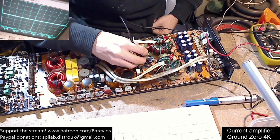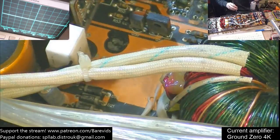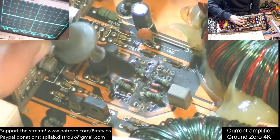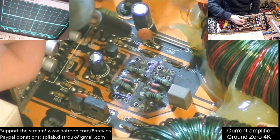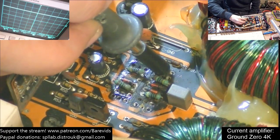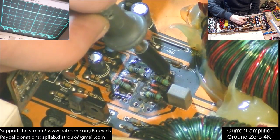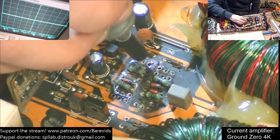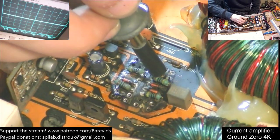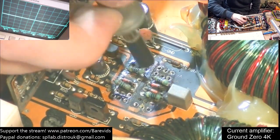There's something that's not good here. Let me show you what's going on - this is very important and will make all the difference as to whether this thing is going to explode again. We have spaces for eight driver transistors - four PNPs and four NPNs. The NPNs should have positive 12 volts on the middle pin. Because the traces are so badly damaged they don't all have it on the top of the board, some will be on the bottom. On the PNPs we should have zero volts on pin two.